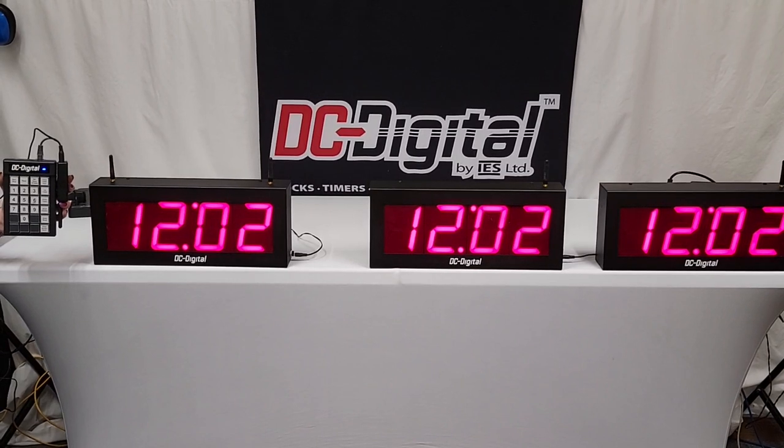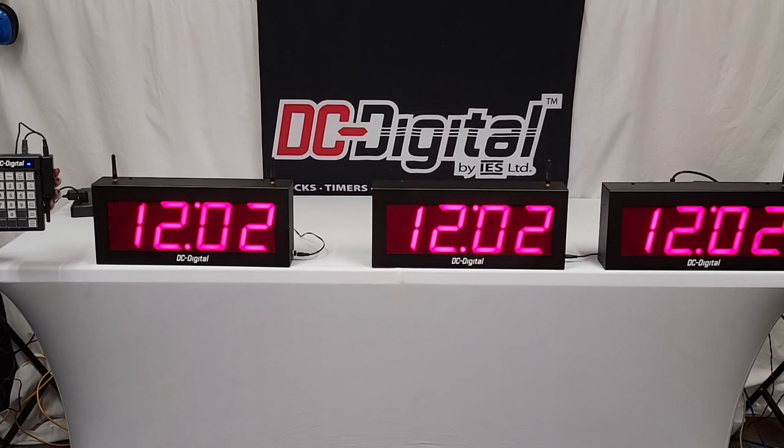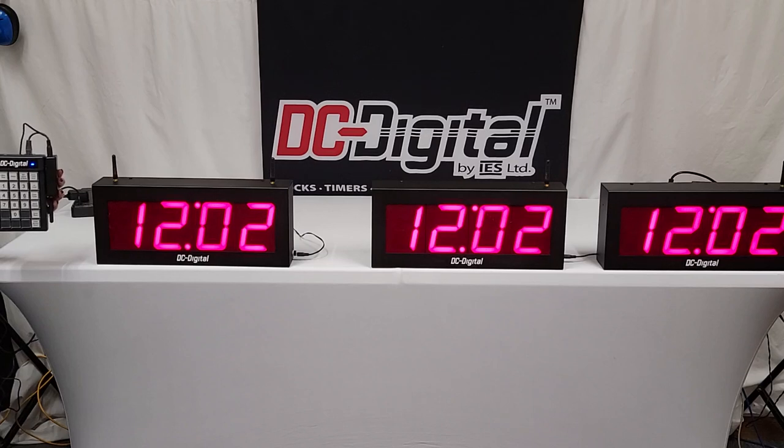You can see over there to the left — she's going to be demonstrating how to use the keypad to set up the timers and the clocks. 900 megahertz radio transmits out to the master, and then the master transmits out to the two secondaries. Everything is within 1,500 feet. You can add as many secondaries as you like. It's called a store-and-forward system, and you can go infinity with them as long as they're within 1,500 feet. That's outdoor range — we stipulate 350 feet indoors because of walls and obstructions. These are 4-inch LEDs in an all-aluminum extruded enclosure with 120-volt wall adapters and a 6-foot cord. Each one needs 120 volts.